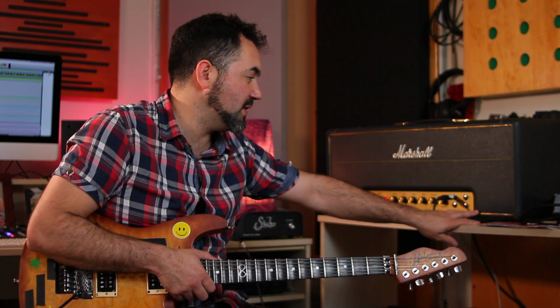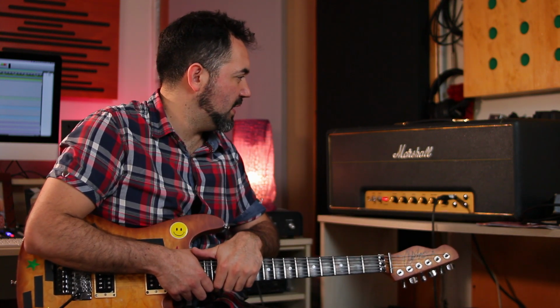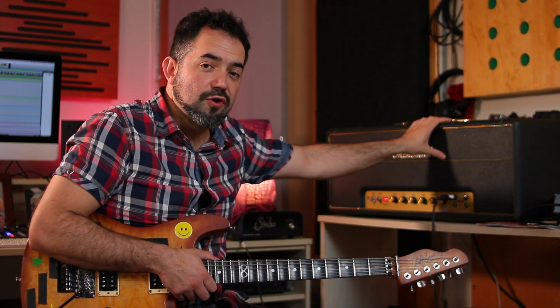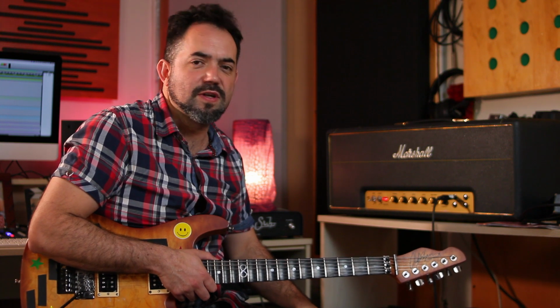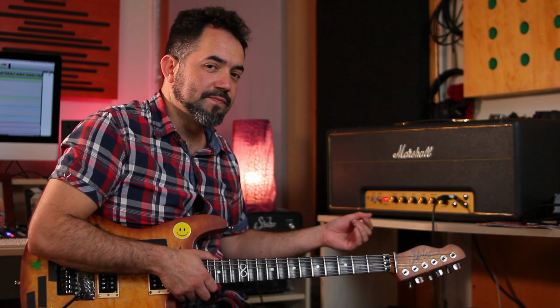The main difference, I think, with this guy, is that the rectifier stage on that amp was tube and this is solid state, so this has a faster, bolder sound. And this is 100 watt, there's 50 watt versions of course, and there's some combo versions that are closer to the JTM 45, right? Between 67 and 72 it's considered the golden age of this model, and it has a lot of variations, mainly in the choice of the components.